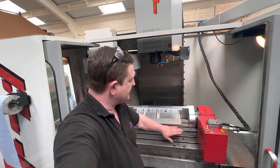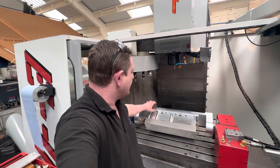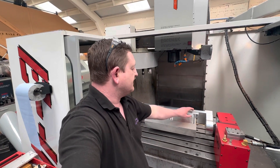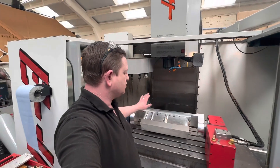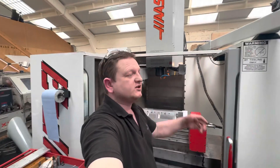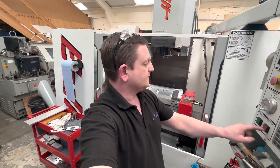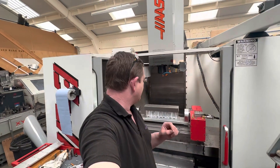The only thing I've got to do now is check tool clearances, because when we did the previous ops in vices the vice jaws were only up to a certain point and everything else was clear. I need to make sure tools will clear all along here, and I may even model this fixture into the part in CAM to make sure everything clears and we don't run into any issues.